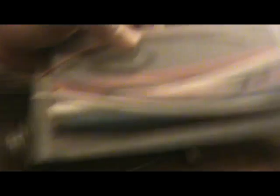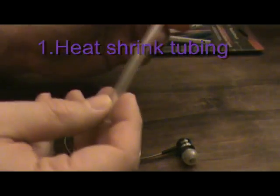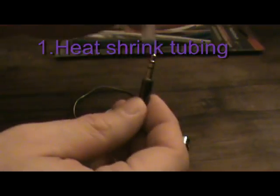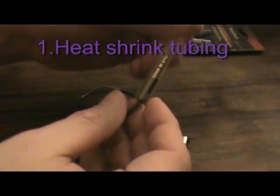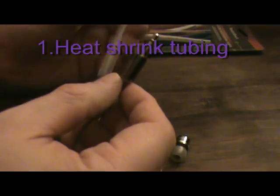What we're going to need is our brand new headphones and some heat shrink tubing. It usually comes in an assortment — you can buy it in individual pieces too in some places. This is from Radio Shack and has a nice assortment of colors and sizes, and some are thicker than others. The piece I'm using today is clear plastic and just a little bit thicker than the actual plug. You want to start with something just a little bit thicker, and you can see that it fits pretty tightly — that's going to be good because heat shrink tubing only shrinks so much, and you want a very snug fit. You could certainly use one of the other colors too.